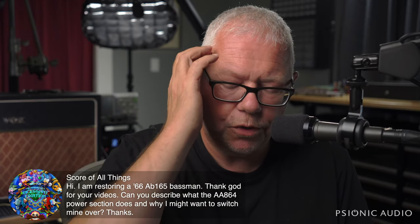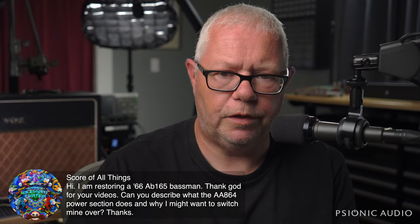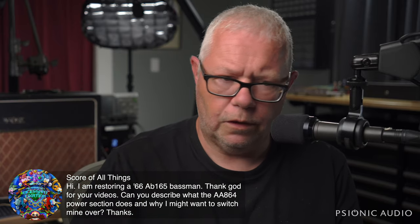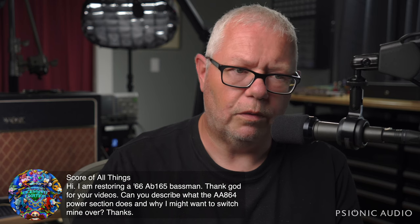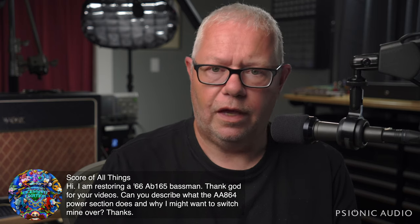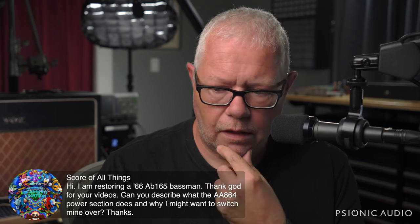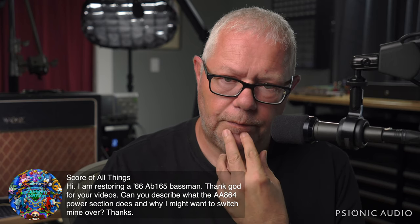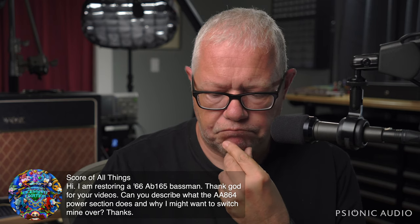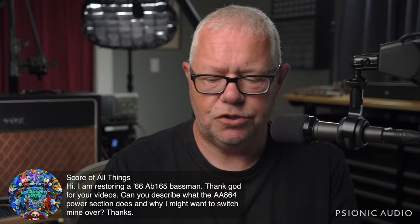I have a video up here showing one with the AA864 output section compared to the AB165 output section with the amps otherwise the same. But that was a while ago, and I did that on my cell phone. I need to revisit that at some point with higher quality audio. I find that the AA864 power section feels better as a player, does not have the background noise issue that the 165 output section has, and there's no downside to that. You don't lose any maximum gain. You just get a nicer transition.